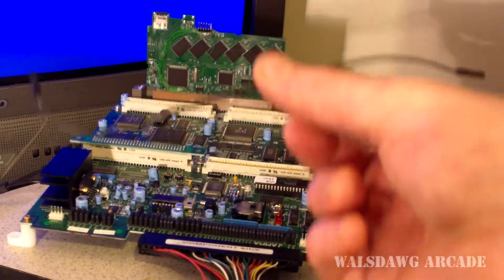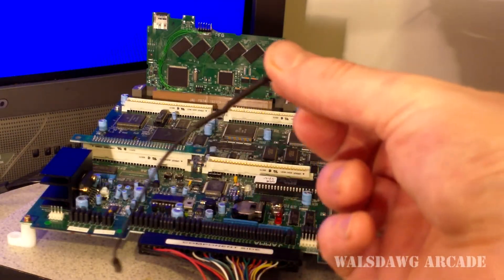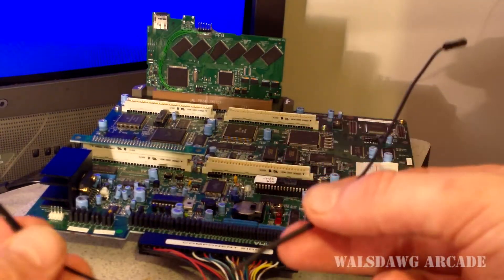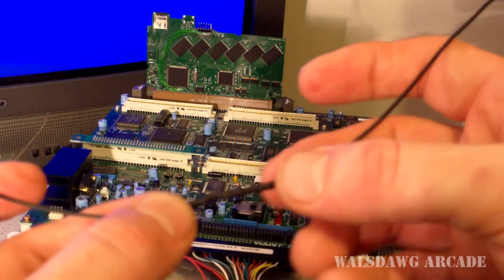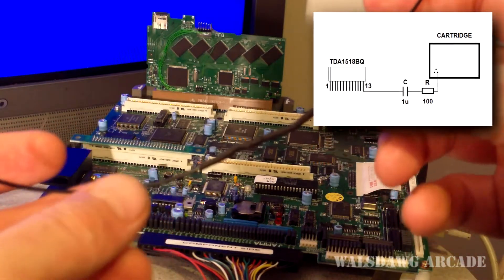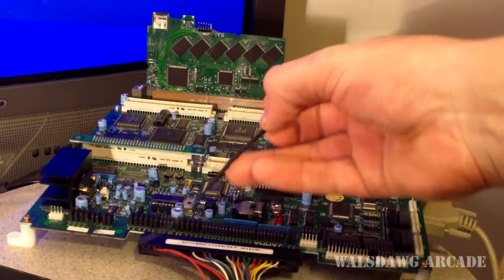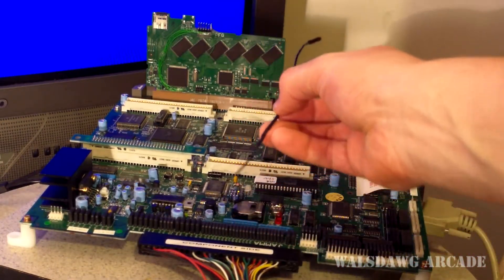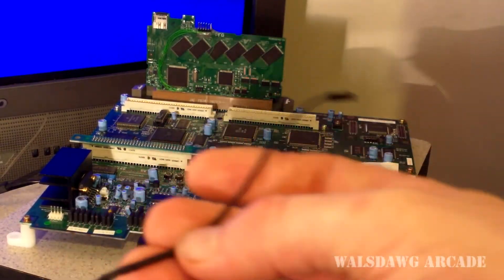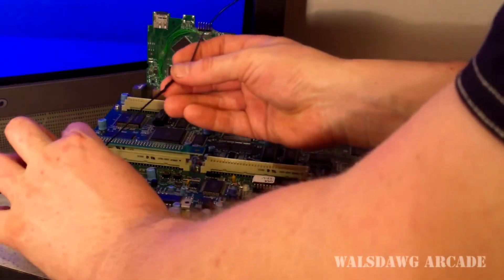I will sell it as a convenience — it's not very hard to make, but I do have all the supplies to make it, so you can just purchase one directly from me and I will ship it when I ship your cart. As you can see, I have the two ends here and in the middle is heat shrink tubing. On the inside is the resistor and the capacitor needed for the mod. It's sealed up so it can't short on anything, because with my old crude one it would occasionally lean down and short out, causing all sorts of sound problems.